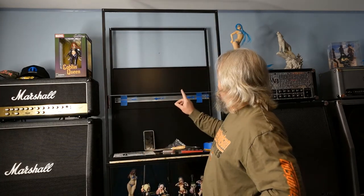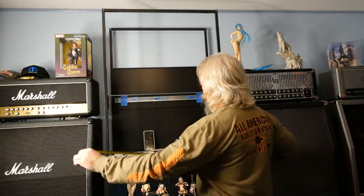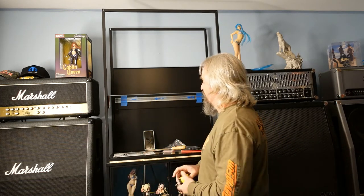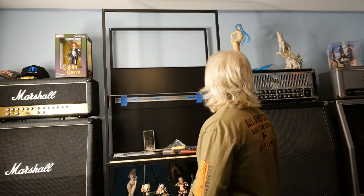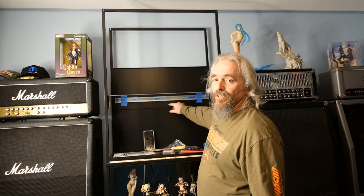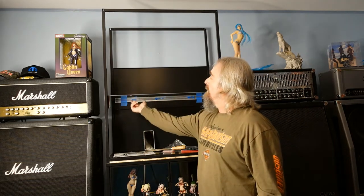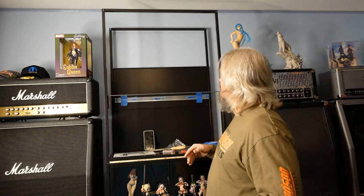All right, here we are, we are back again. Now, as you see, I have the glass in here already, and we are at 16 and a half inches clearance, from the bottom of this to the bottom edge of that glass. What I wanted to do, I still got to add more screws here. A couple screws have been put in it, but I want to check it, make sure it ain't flopping and sitting wobbly in there.